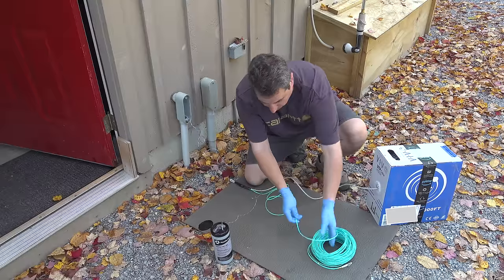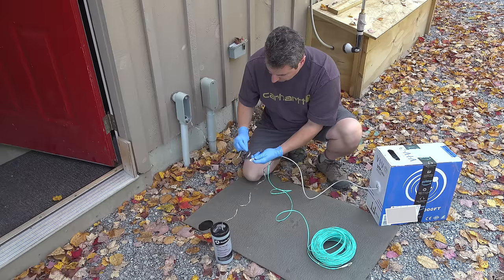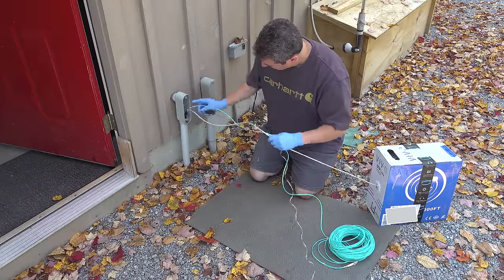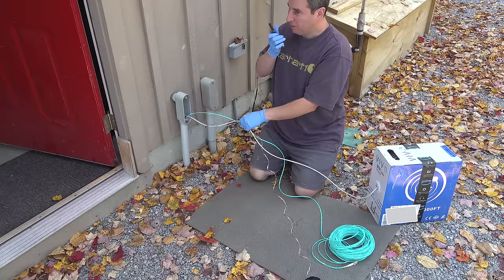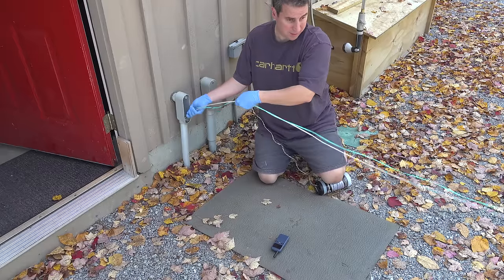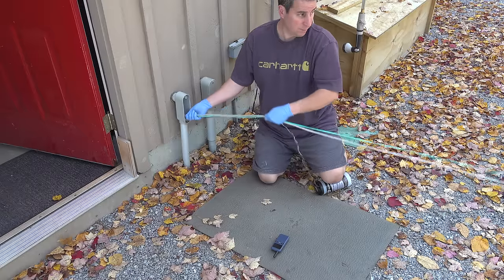With my second volunteer, I'm carefully feeding this fiber into the pipe. You can work on either end — I just felt this open area was going to be better for the actual feeding. Stop for a second — why is this all wet? Am I touching something gross? It's just water. Make sure as you're feeding it through that the cable doesn't get bent, so feed it in slowly. It turns out this pipe was only around 220 feet long, so within a few minutes, fortunately, the fiber emerged and everything looked pretty good.